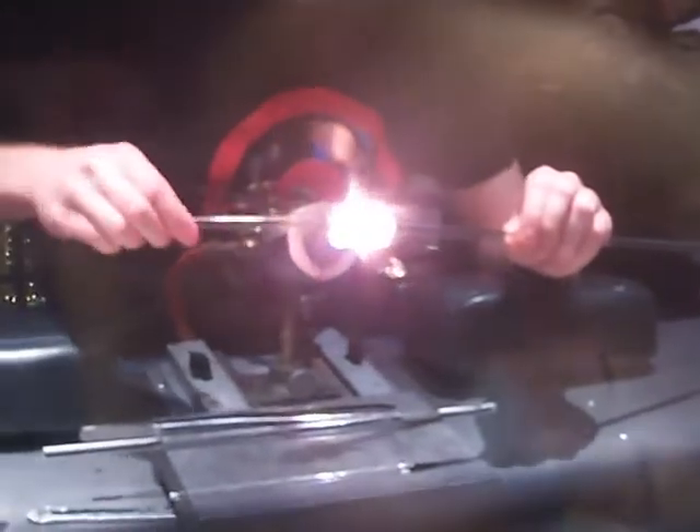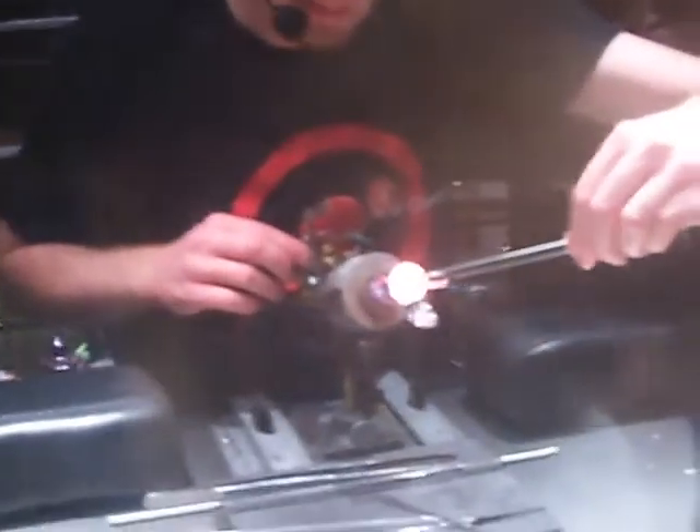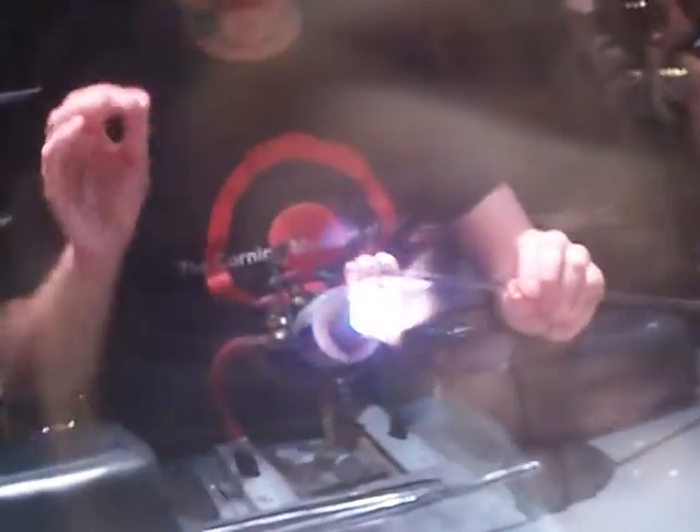The type of glass I'm using is actually a very special type called borosilicate glass — we call it that because it has boron mixed into it. The boron is an element that works as a stabilizer in glass. It increases the overall melting temperature and makes it much more resilient to something we call thermal shock. Thermal shock is when any material undergoes a huge change in temperature in a short amount of time. A good example is when you pour warm soda over ice cubes and the ice cubes crack into pieces. That can happen very easily in our little glass sculpture — the thin parts cool quickly, but the thicker parts hold heat longer and cool slowly. That uneven cooling puts stress in glass, and too much stress equals shock. The boron makes the glass more resilient to that big temperature change.